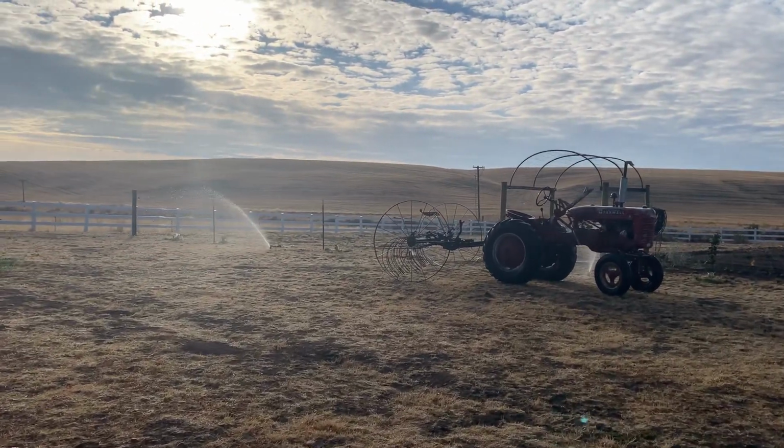And so, when the sprinklers are pretty much done having the water in them, the heads will start lowering back into the ground. It'll just start burbling, and then is burbling a word? Burbling. It is today. They're burbling. I think they're bubbling. Bubbling, burbling. Okay, we're making up our own language. And so they'll finally go back down into the ground, and that's the indication that the water is out of the line, and there's just air in the line, which is what you want. Okay, so when the sprinkler heads lower after they're burbling, gurgling, or bubbling, they are pretty well done. Okay, we're doing the front side now.